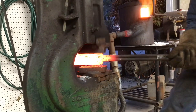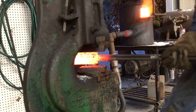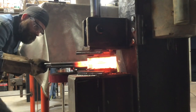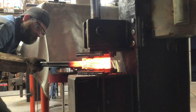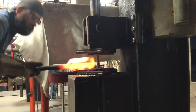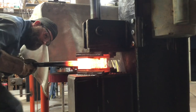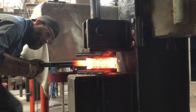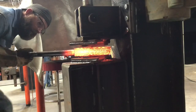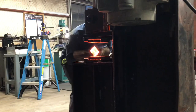The press takes so much heat out of the billet, and since I haven't got my welds fully set yet I like to start with something that won't pull the heat out. Even as I head over to the press I take it pretty easy on the first pass — the billet is fresh, it's new, there are like 16 welds in there. But as I move on I'll get more aggressive. All I'm doing right now is drawing the billet out to the point where it becomes square — the same height as it is wide. You can see I'm getting real close to that, so it's time to move on to making W's.